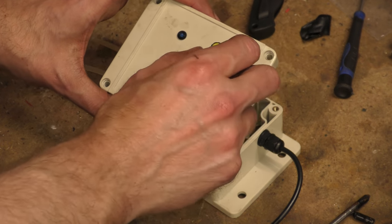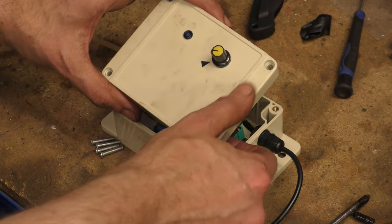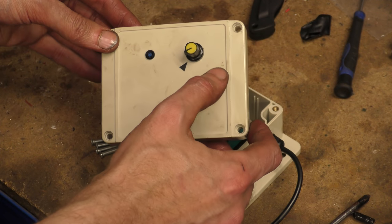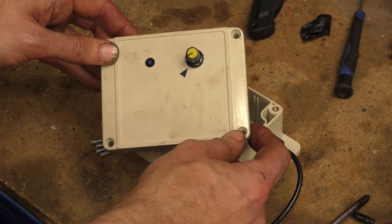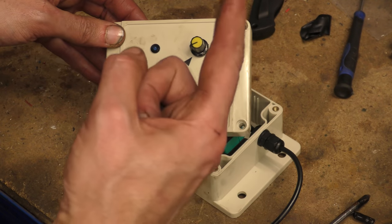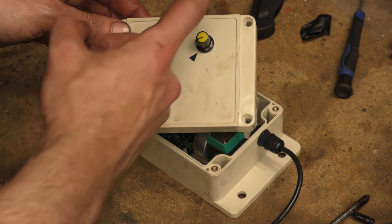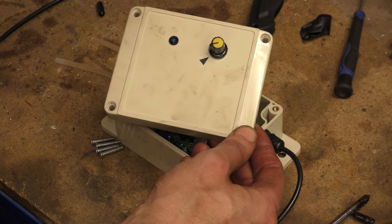On top of the box there is a potentiometer for fine-tuning the quantity of injected fuel. It usually leaves the factory lined up with the arrow. This is made by a man in his workshop in his spare time - so please, if you are placing orders, bear this in mind. He is one man making them by himself in his workshop. I tweaked it a little bit to get a bit more heat, because I've got a temperature sensor in the burn chamber and I can see exactly what the flame temperature is.